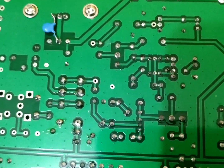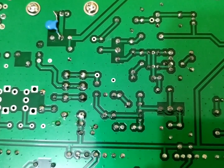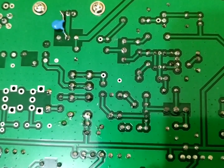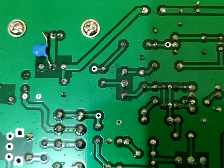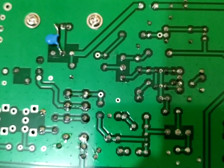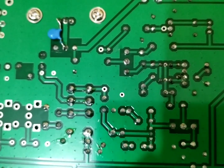The third mod requires a 220 pF capacitor from drain to ground. This is also very important to stop any parasitic oscillation or imbalance in the amplifier.